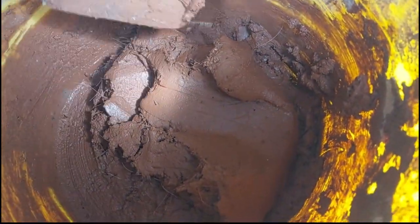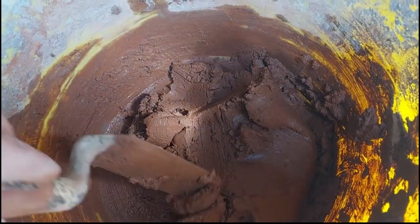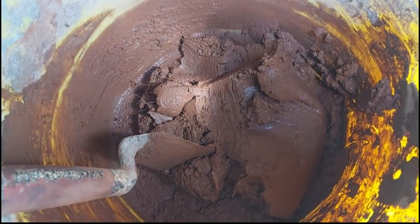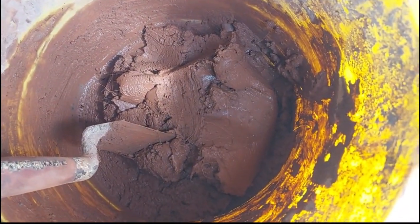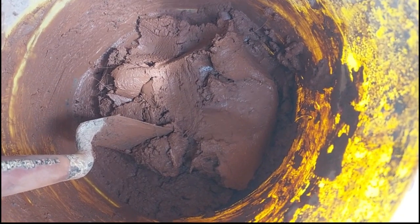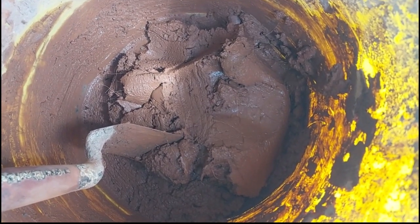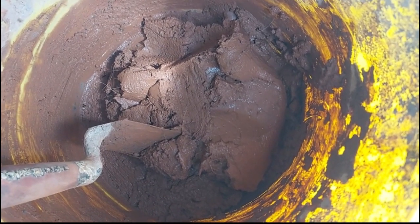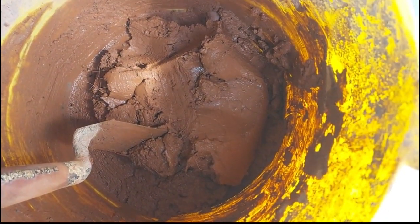I'll show you the mortar that I'm using. It's a little bit different than normal sand cement mortar. This is the stuff. I don't know if you can make out the hair in that. That's your animal hair, and that will help knit it all together, bind it together, reinforce it all. And it has got a touch of lime in there as well. So you've got a normal standard 4:1 cement mortar mix with a scoop of lime in, only a tiny bit. Some earth pigment, which is a brown, and again just a tiny bit of that, just to set it off a sandstone colour. And yeah, your sand and your cement and so on. And there you go. That's what we're using.